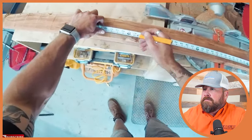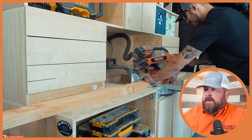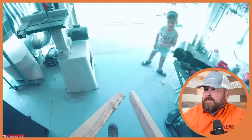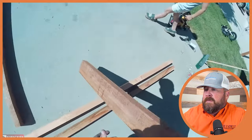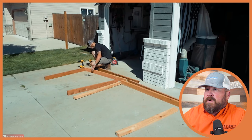The overall distance opening on the trailer gates he wanted to be 135 inches wide, with a height of 73 inches tall. That means roughly 65 inches per gate — about an inch on each side to open and close. That's a little bit over five feet of leaf, giving a little bit over a 10 foot opening. Five feet would probably be the limit on what I would want to do with wood frames — anything more and you're really tempting fate on that thing sagging.